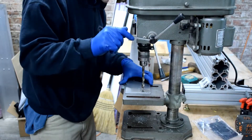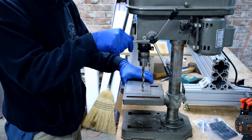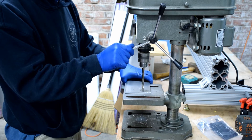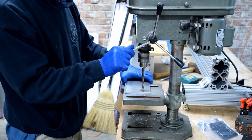After the pilot holes are drilled, it's time to move on to the 3/8-inch holes. I find it helpful, at least with this little drill press, to use some cutting fluid. Cuts nice and smooth, leaves a nice finish.